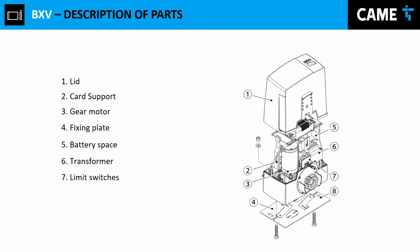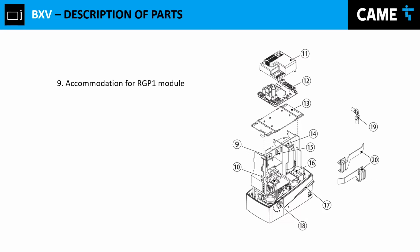Limit switches, right there you have the limit switches. That's the indicator. That limit switch indicates the gate when to stop, when it's either closing or on the opening stage. This hole for passing cable, if you're using our anchor or our base for the installation, you have that place to run some cables through. And I'll get into more details about it. We're going to keep going with a different part.